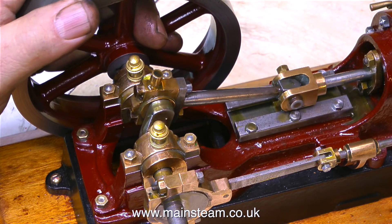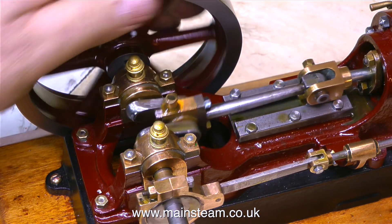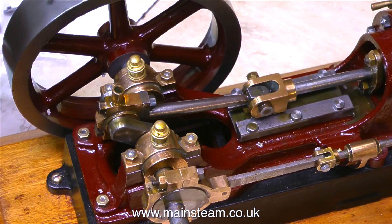So where do we go from here? The whole point of this is for me to give my customer an assessment as well as an estimate for repairing the engine. When I look at how many hours it would take me to repair this engine, plus the additional costs — having to buy a new flywheel, machine the flywheel, make a new crankshaft, sort out the main bearings, sort out the crosshead alignment, make new big end brasses, a new pin for the crosshead — and that's before I look at what's going on inside the cylinder. So the final summary is that this engine is beyond economical repair from my point of view. You have to take into consideration the initial cost off the auction site, add the cost of a new flywheel and my fees. Much as I'd like to help out and repair this engine, I really can't because it's impractical. Be very careful what you buy online — buying from internet auction sites is not always a bad experience. That's it for this video, thanks for watching and I hope you found it useful.